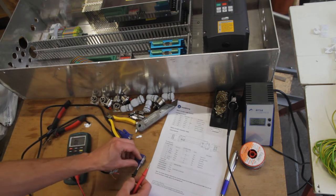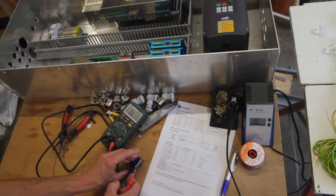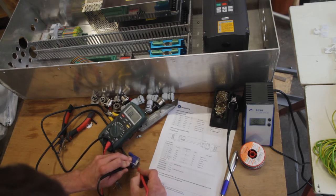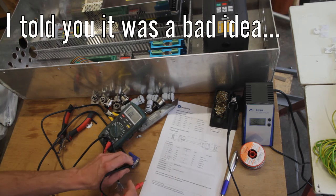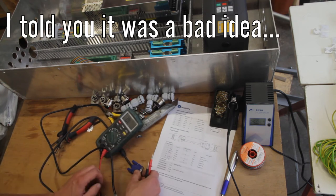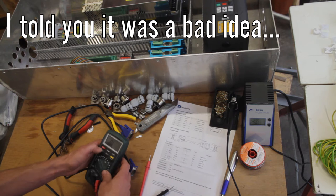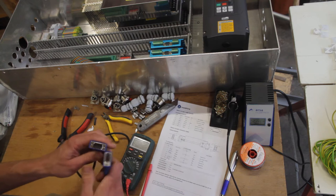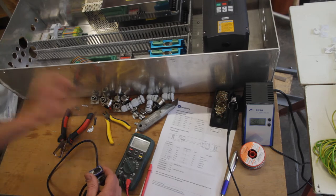And what happened actually was, if you look at this, if I connect the ground to pin 11, you can see it connects through, which is really a problem because this will also be the earth, and yeah, so we cannot use the default VGA cables, and I will have to order some male plugs for here, and females I have already.